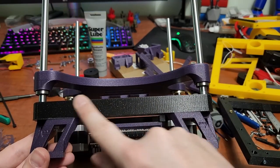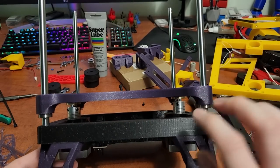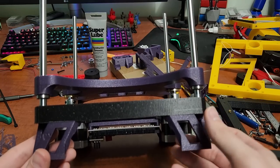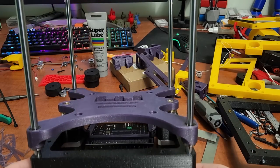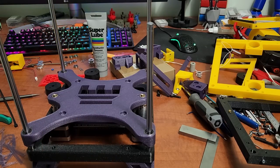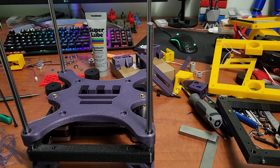This is the latest revision, what I'm calling Release Version Mark One of the base. I've made those holes a little bit smaller to make sure you can thread in M5 by 10 bolts. This is my new bed frame — it uses less plastic, it's like 30 or 40 minutes quicker to print, and it has the Rook logo in the middle which I really like.